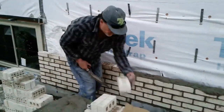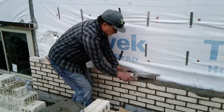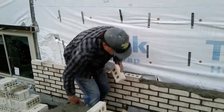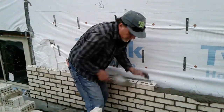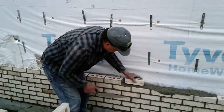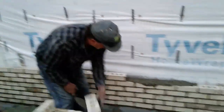As you can tell, I'm throwing that first head joint, which is this one right here, and you come over the top. That's a head joint. There's supposed to be a full head joint in there. Makes for a good, solid wall. And the whole time I'm laying these, I'm just pushing them down. I can pretty much do this blindfolded, but I'm watching the joints, keeping them straight.